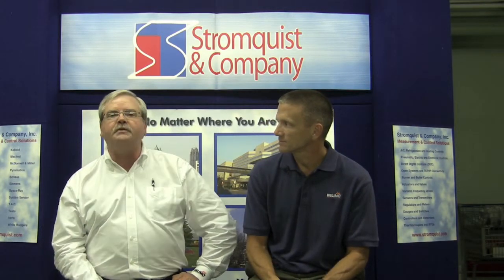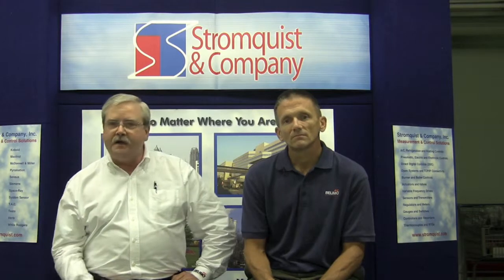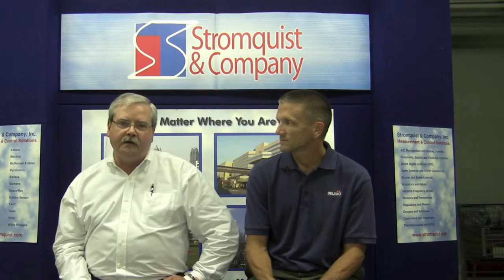Mark, the other topic that came up today here at Stromquist, and I hear it over and over, is a lot of discussion and questions about valves that advertise 300-to-1 rangeability. Talk a little bit about that. Sure, Kevin. Rangeability and turn down are closely related terms. Eric's going to be posting a blog entry from me in the next few weeks dealing with this subject in pretty great detail. For now, let's just leave it at the fact that rangeability is a laboratory measurement of the valve body, whereas turn down is a measure of the performance of the valve assembly, including the actuator in the field. The higher rangeability, the better, up to a point.